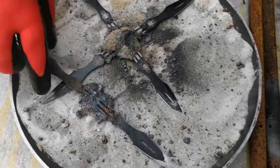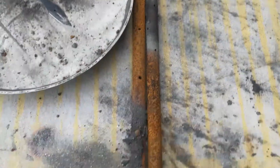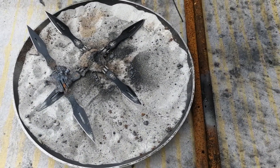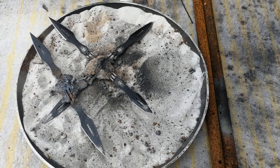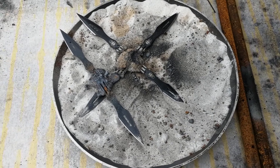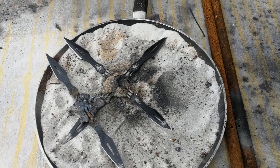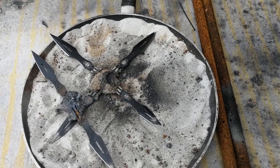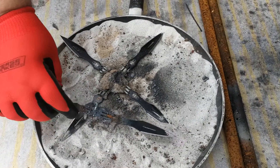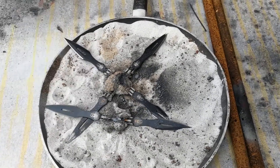So we had two successes and one failure — the metal bars. Having a flat, clean surface seems to help. The round, rusted surface didn't do so well. In the future, I'll clean up those rusted bars and see if we can try again. I might have to look into the shape and form of the thermite needed for getting a weld like that. I hope you enjoyed this — consider liking, subscribing, and sharing, and we'll do some more thermite in the future. Thank you for watching.